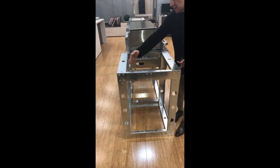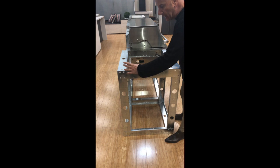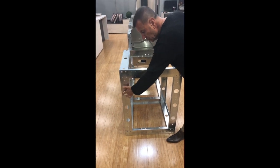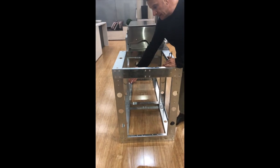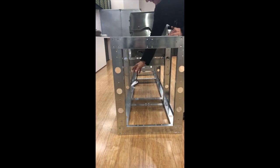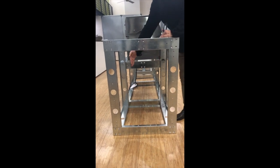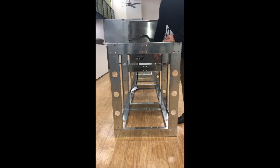All our cabinets finish at approximately 570mm, giving about 100 or so millimeters to allow for services to be run from one side of the frame to the other, including gas, plumbing, and electricals. It also allows for a power point to be integrated to the back of the frame so that when the appliance is pushed in, it is clear of any electrical connections.